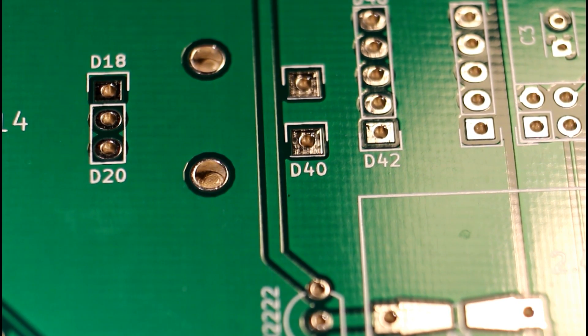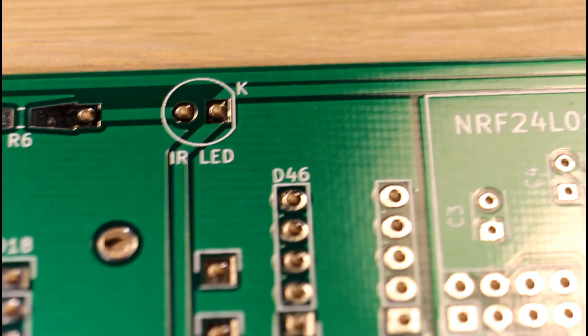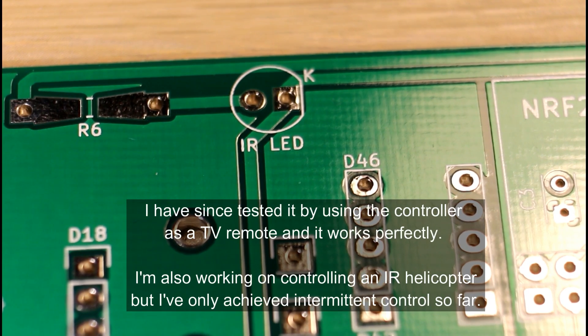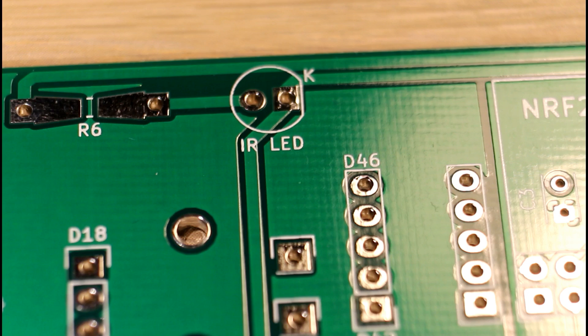I think the encoders will be a little bit better. Another problem with those sliding pots was getting the plastic knobs — they seemed impossible to find, so I would have had to change to a different type of sliding pot. The encoder just uses a normal cap that you'd get on any potentiometer, so that was easy to source. I also included holes here for infrared LEDs, but I haven't got that working yet so I can't 100% say that'll be perfect.